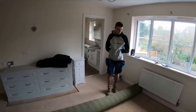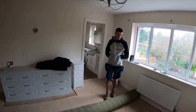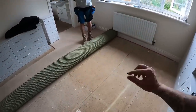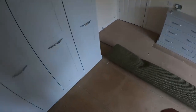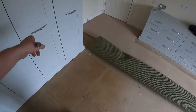There's two ways. Either you can take the tongue and groove off it, which will be a smaller cut, but you're just running the blade down again. With a circular saw, I'm happy to set the depth. There'd be no plumbing around because it'd be set in the centre of the joist, not across the top. We'll do a channel. The only issue is this wardrobe, which has a base to it. We need to make sure that we haven't got a downlight directly there.